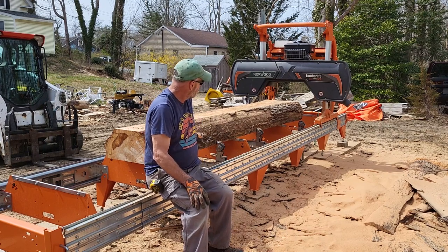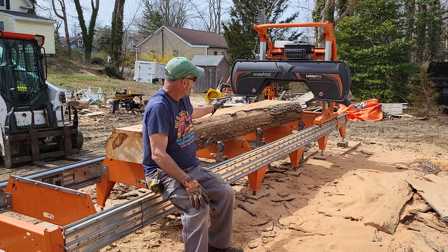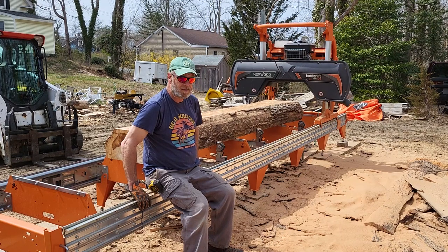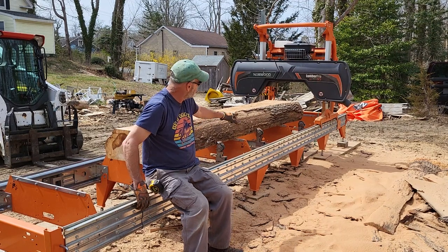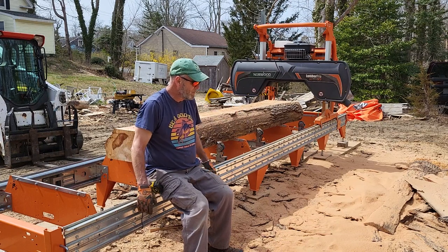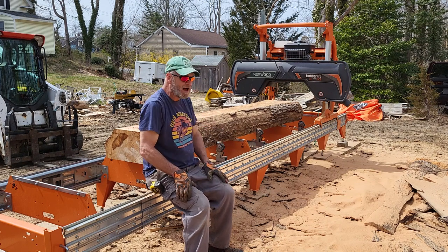We're going to go ahead and mill the rest of this out. But I want you to be able to hear the saw head, hear how it's loading, and hear how the band's running. The band is starting, it's not brand new. It's starting to get to the point where I have to push it, especially in the beginning at that full width cut. But down here, I can go as fast as I want. It's still cutting really smooth and flat.